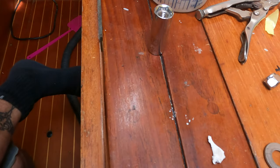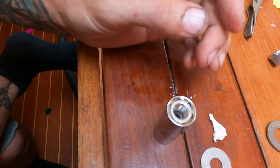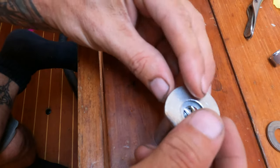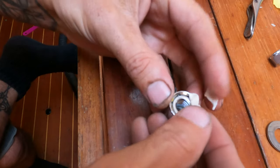If you remember earlier in our video we put bolts on the legs of our hardtop. I didn't have access on one side of the boat here, so here we can see now where the wires come into the boat with the bolts. I was going to try to put a backing plate on there but that's just not going to work. I'm going to use some really big washers — I'll probably have to shape them just a little bit to get them away from the edge. To reach way up inside that combing, I just put a spare nut inside the socket as a spacer, then the nut I'm going to be using, then my top washer, then the big washer that I took a little nibble out of. To make these stay in place I'm using a little bit of butyl tape and sticking it on here so that they all stay in place.